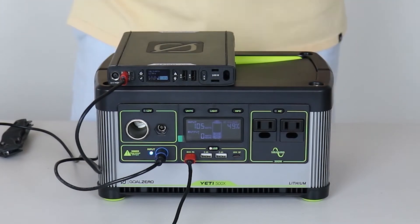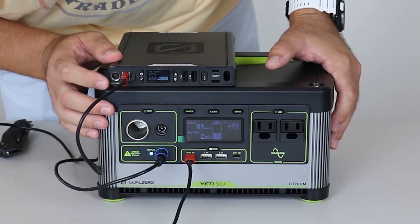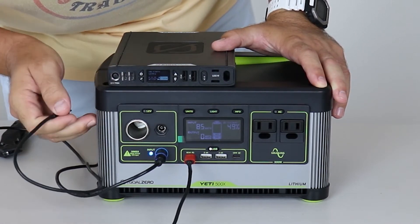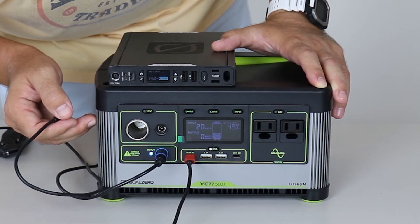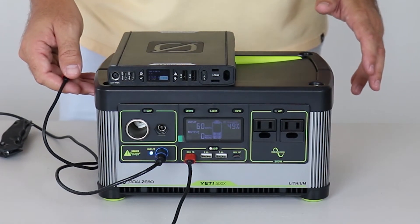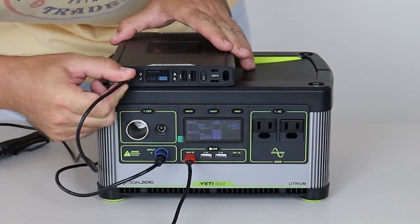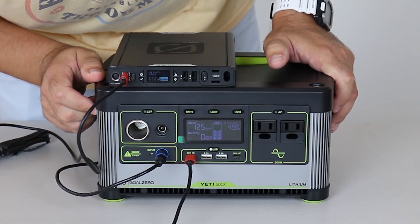It's supposed to go all the way up to 180 watts, so obviously I'm losing something here because this is charging at pretty much a continuous 55 watts and my sunlight outside is nearly at full power. This thing is jumping all around — let me take this off and see what happens. It's showing 20 watts of input right now, which means I have some shading going on outside. The sun looks like it's coming out now, so we're jumping back up: 65, 75 watts. Plugging back in — 70 watts, the sun's maintaining. 125 watts at the beginning here.